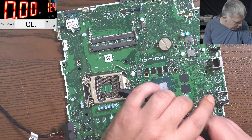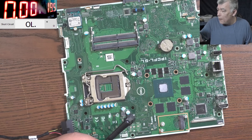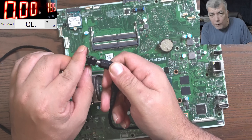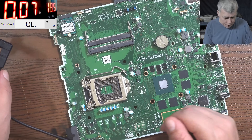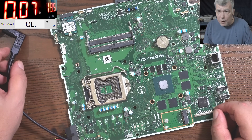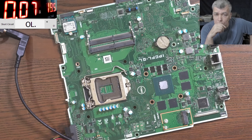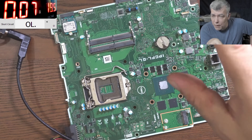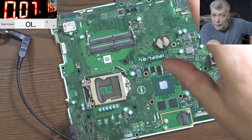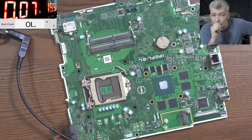We have our power supply — let me find an adapter. Let's switch to 19 volts and plug in the power. It's taking 60–70 milliamps, which is not right. On a motherboard when it's off, all that's powered is the 3.3V supply to the EC chip — so 70 milliamps doesn't look good at all.